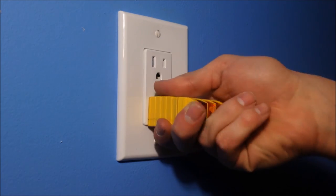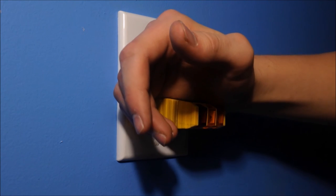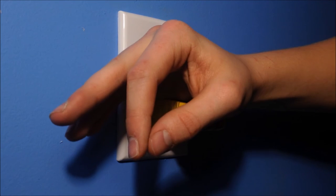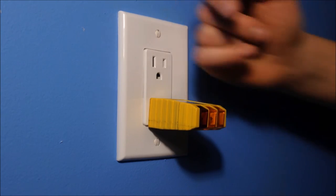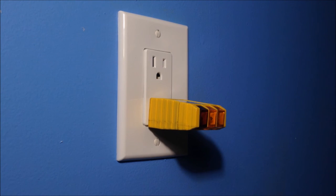Plug in your tester. Turn on the power. Come back here and check this out. If you turn on the breaker and that breaker trips as soon as you turn it on, which will be a little tick, and it'll get stuck in the middle, it's no big deal. Turn it off. Come up here, take this out and look at it again. Fix it, as I said in this video. If that problem happens again, stop, call your electrician, call somebody who knows what they're doing, and take a look at it. Hey, shoot, call me. Chris will help out. Because there might be a problem with your wires. They might have broken in the back.